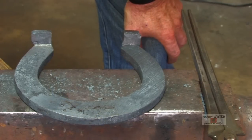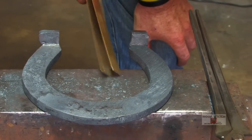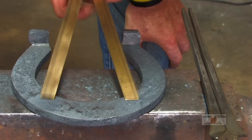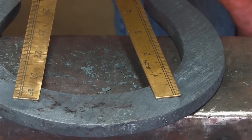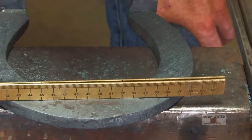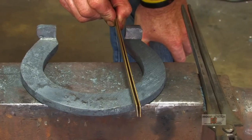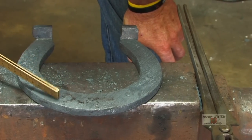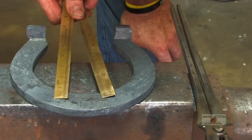We can't use any other fuller than the fuller we made for the class, so we did it with our head stamp where our fullering begins. What it does is it keeps the branches, when you turn each branch, it lets you see that the branch is underneath the toenail. We're four heats into it. We bump the toe, we turn the toe, outside branch, inside branch. If I was four heats into my fuller, I would be ready to start bringing the fuller together with the shoe. So I've got this shoe made, and now we're gonna marry it up with the fuller in.